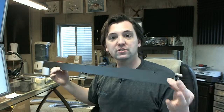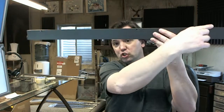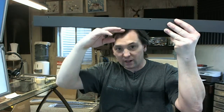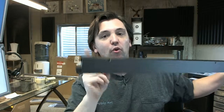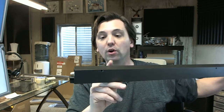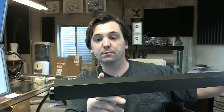This has to go on the lock side, mounted on the push side of the door — it's the only side it can be mounted on. When it's mounted on the push side and your door closes, the plunger will come into contact with the stop of the frame. When you continue to close the door, the plunger has nowhere to go but in, being stopped by the frame. That is the action that forces the giant flat spring inside to push against the inner channel and force the bottom to drop down.